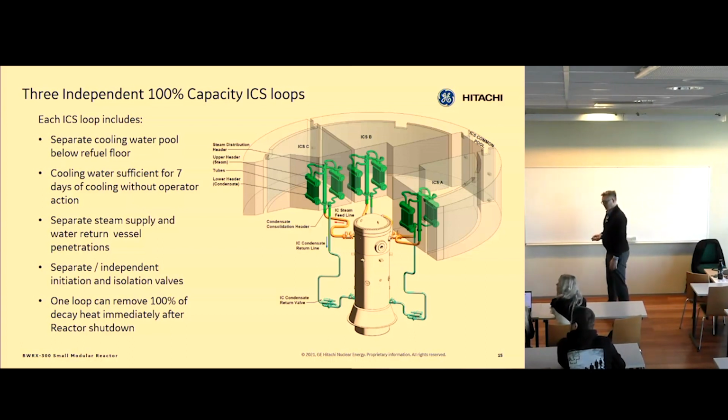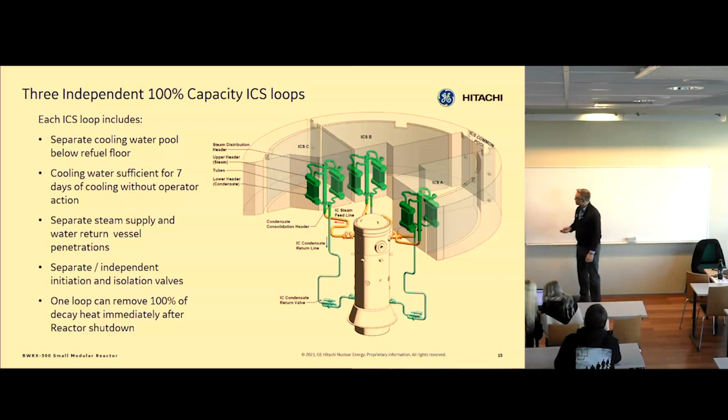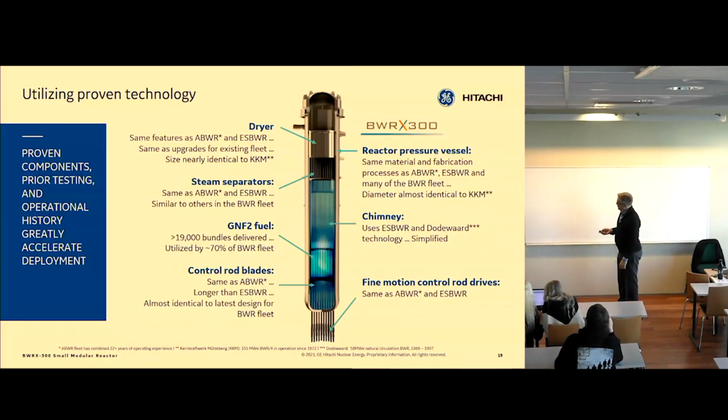If I may, you mentioned that you scram the control rods simultaneously. But if you are unable to, is that also a possibility? The system can accommodate that event as well, but we have several means of inserting the rods, and we have a very granular approach. I'll go through that a little bit later, but we've eliminated that to the best of our ability. It's still in the realm of what we analyzed, and we have analyzed that event.